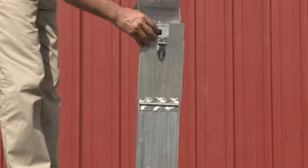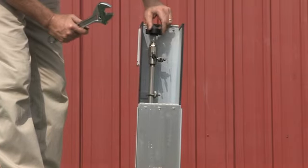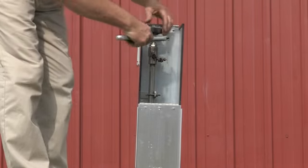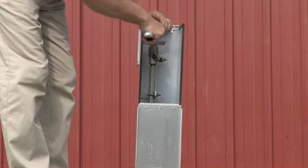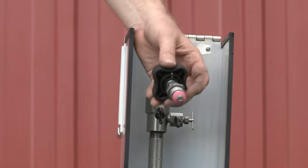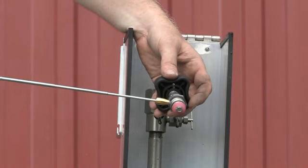To do maintenance on the main guard 66 WC sampling station, first shut off the water to the unit. Second, open the hydrant all the way, allowing the plunger to come up out of the seat. Unscrew the hex bushing above the nozzle and below the handle, and then lift the working part assembly out of the unit to inspect to see if the seat gasket needs replacing.